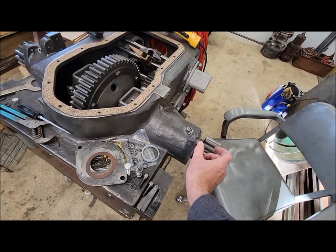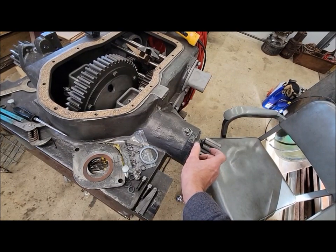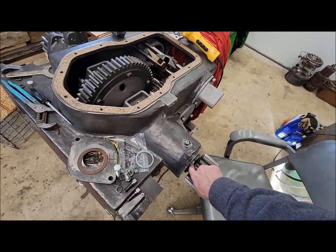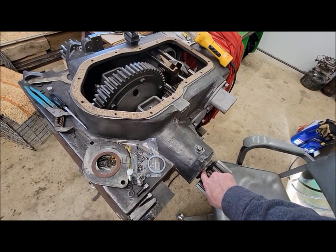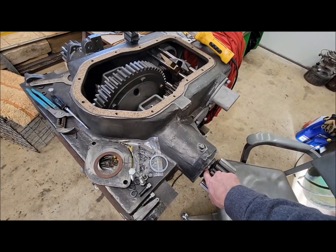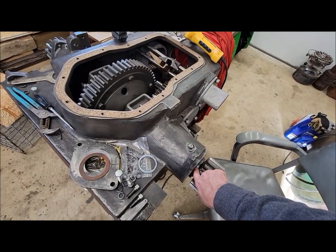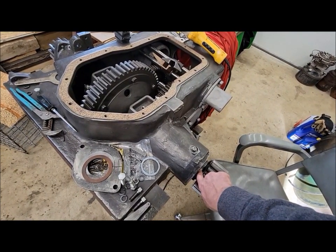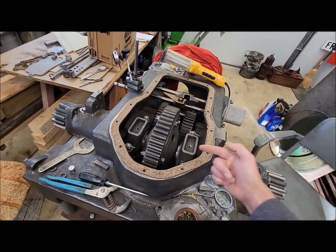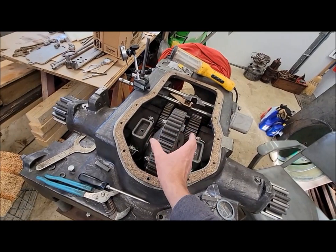That keeps your pinion axle riding in the location it should be, keeps that centered, so to speak. The parts book just calls that a fiber washer, and it's like 94 some thousand thick. So to compensate for wear on everything, we've figured out that if we find material that's 100 thou thick for either side, it works out where everything is basically bumped up tight to the differential. That takes all the play out of everything.